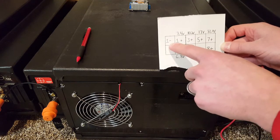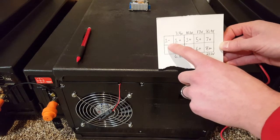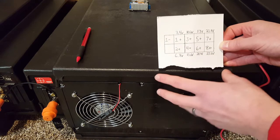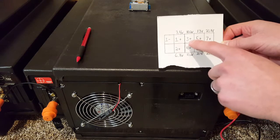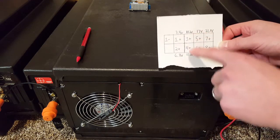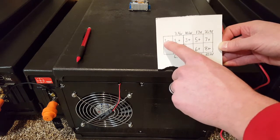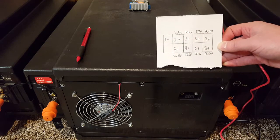The top left is my main battery negative — that's the first cell negative — and then I went first cell positive, which at the current state of charge is about 3.4 volts, second cell positive, third cell positive, fourth, fifth, sixth, and so on. All of these numbers show what we should expect to get if we put the negative of a voltmeter here and measure all of these voltages. Let's go ahead and do that now.